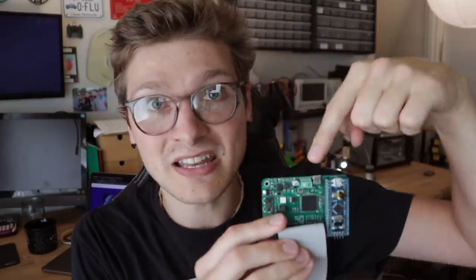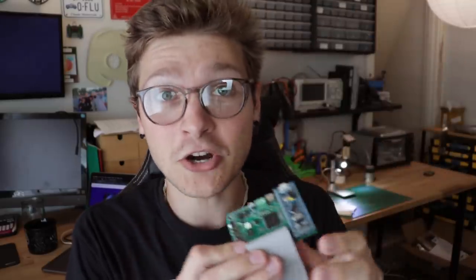I did think about adding a USB hub onto this board just like the motherboard has and just having it all go through one USB port, but ultimately I decided I didn't want to put any other weird things in between a raw USB connection in here directly to the target board. I wanted it to be as clean cut, isolating all the variables as I possibly could make it, because if there's a problem with the USB hub, maybe that's what I'm failing if I can't have it enumerate through this port and not actually that there's a problem with the board. So trying to trim out all the potential things that could go wrong aside from the actual thing I'm testing.